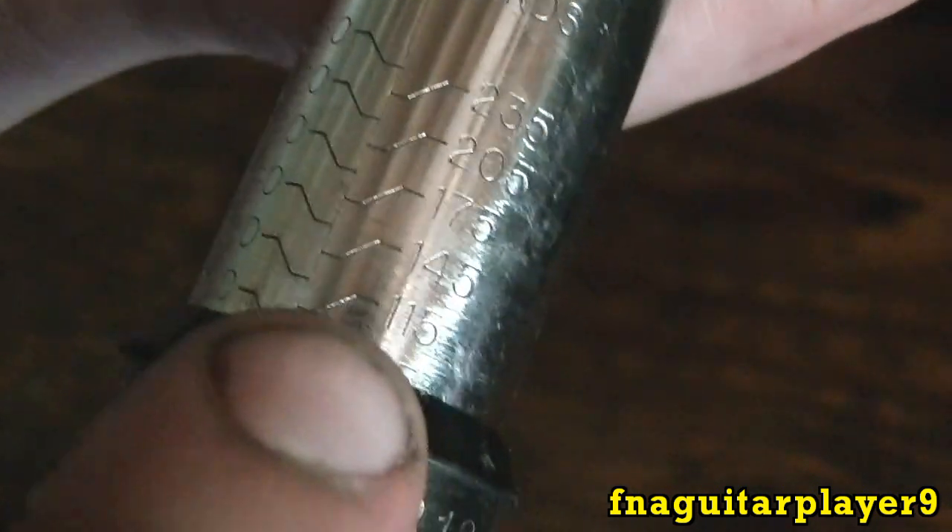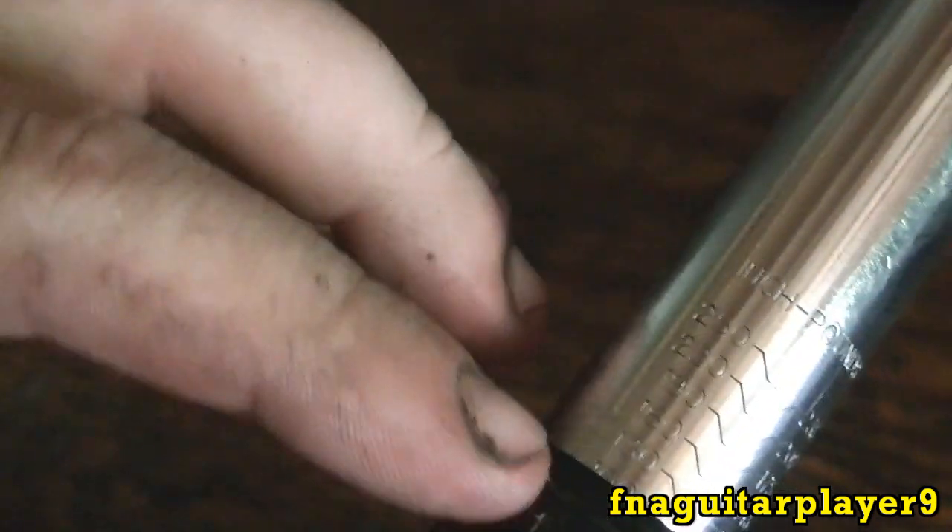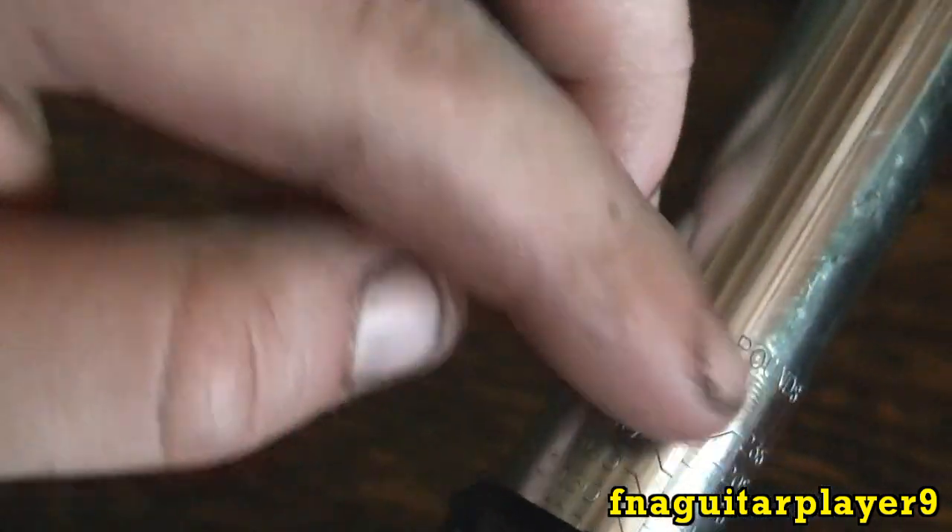You can see the numbers around this ring — that's your individual pounds. Right now we're at 100 pounds. The next mark is on the other side at 115. So you bring this around; there's 14, then when you reach zero it's 15, so now it's set at 115 inch-pounds. That works the same way all the way up through here. It's a pretty simple setup, but it's confusing if you're not familiar with how the marks go.